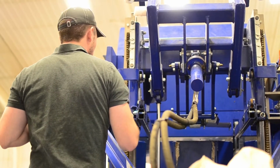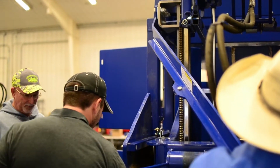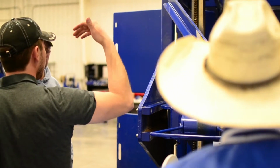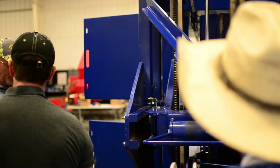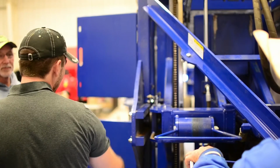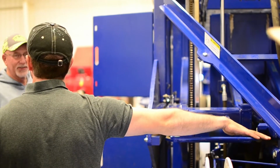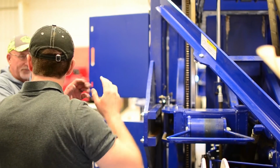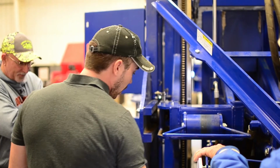And so when those magnets are in front, it will light up your inputs. Okay, so your strap guard arms, there's bale position 0, there's bale position 1, there's bale position 2 and 3. Okay, and all the lights are changed accordingly. You know what I'm saying? None of them line up like the photo eyes. Those photo eyes are in series, that do one. All these are separate.